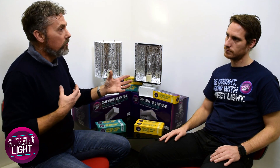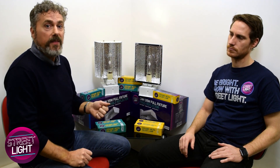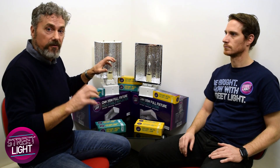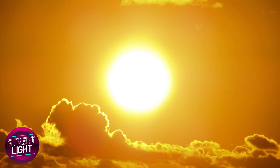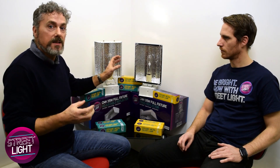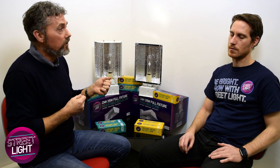We go back to the lamp — the lamp is the key here. Generally with the CMH, there are two colour temperatures: you've got your 3100K, which is your full spectrum, and then you've got your 4200K, which is your more blue spectrum. Your lamp is better — it's full spectrum compared to your HPS. With having a full spectrum, you've also got UV and far red. One of the disadvantages of using the CMH is that you should please wear glasses when you're actually in your growing room or looking at the lamp, because you can damage your eyes.